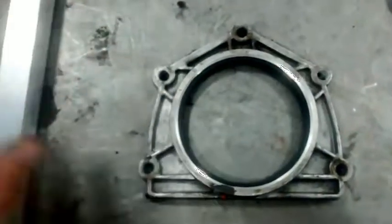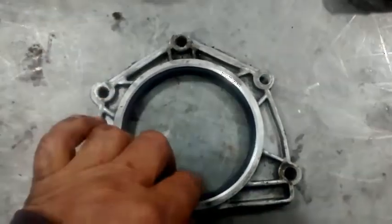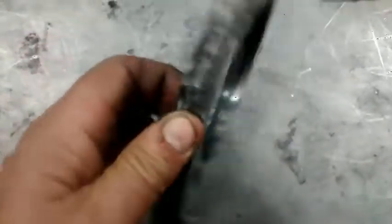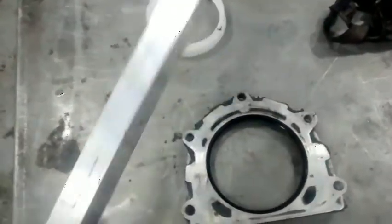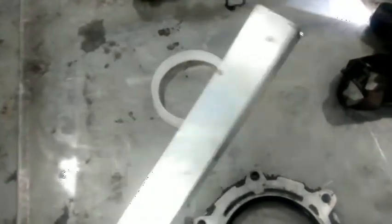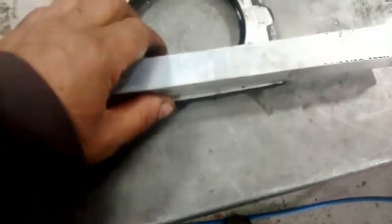It's quite contrary to everything you've been taught. I looked at the seal and it looked okay. I have seen this before so I know what to look for. You turn the seal over and you get a straight edge. I don't have anything fancy but this piece of cut-off aluminum square tubing is absolutely perfect — they're always nearly bang on. I'm going to put the light right here — look at this, can you see the light coming through the seal?